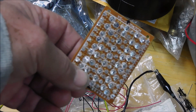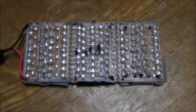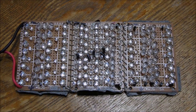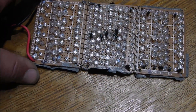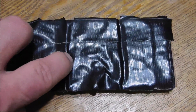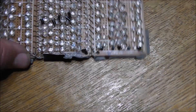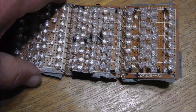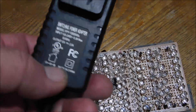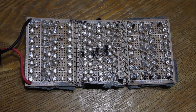That's number one done, out of four. There's my red light therapy pad. You can see a couple of diodes down in there; made a few adjustments, but all in all it turned out really well. I put some gorilla tape on the back side to cushion it and keep everything tight. You can see where I stitched it with some wire to make it flexible, so it'll wrap around your knee, elbow, whatever. Works pretty good. I've got a 2 amp, 12 volt power supply running it.